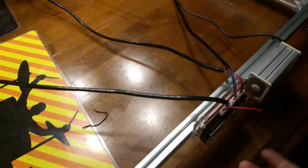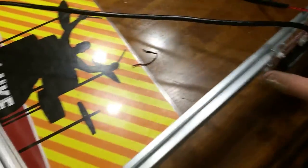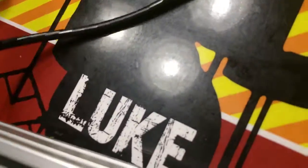Tip three, and this is probably the most important: they do not give you very much wire — it's very short. If I push the machine all the way to its extents, you can see I've stretched this axis taut. There's a little bit of slack I could use, maybe buying an inch and a half, but honestly I'm going to have to splice in longer wires because that's the furthest it can go before it's really pulling.